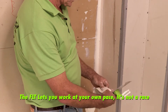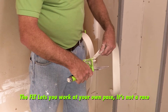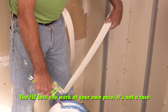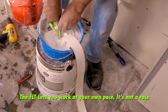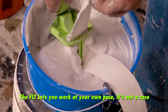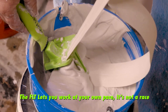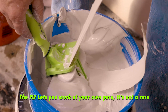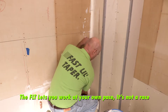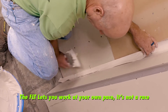Continue tearing tape, making sure the crease is on the inside on the bottom. Feed it through and hold it down the same as before. If you set it more toward the center of the bucket you'll get all the compound you want — you can see how much is coming out, and that's okay, it'll smooth out. This one goes all the way into the bottom corner, which can sometimes be a little difficult.